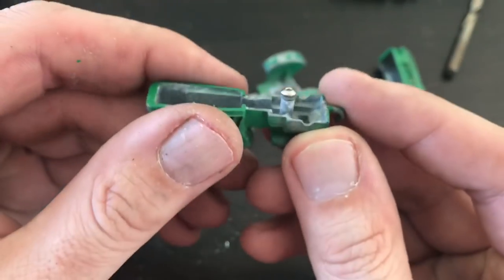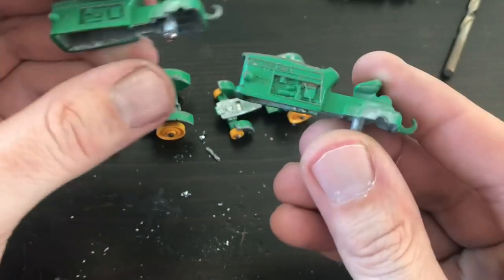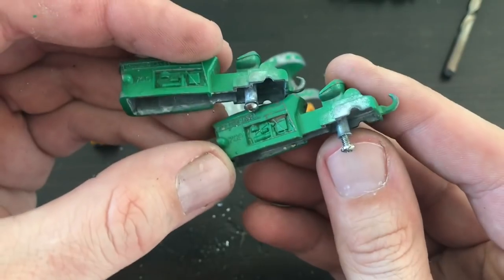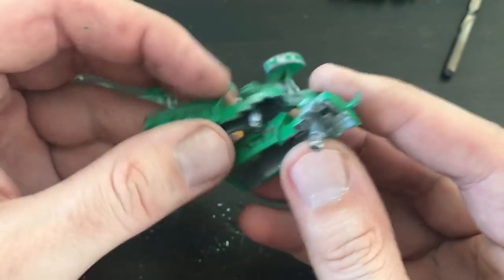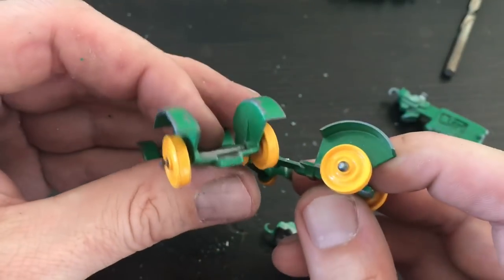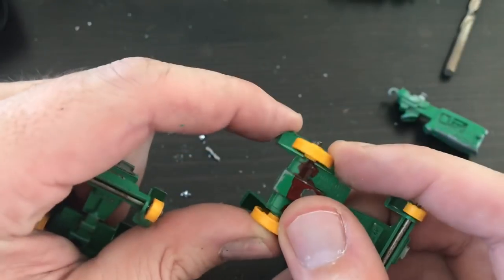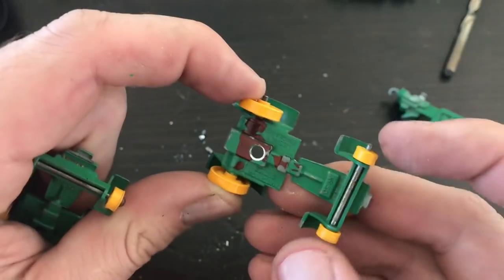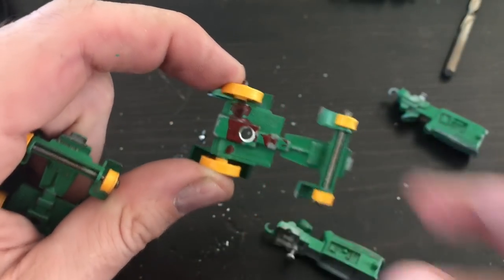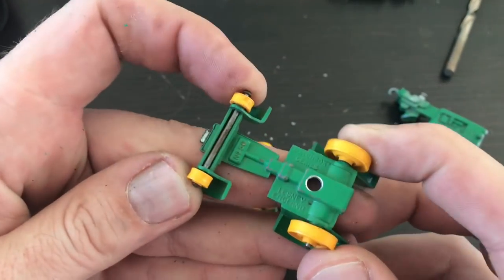With the castings apart, I've gone ahead and threaded our original inner hole, which sets it up so that I can use these button head screws for when we get ready to put these castings back together. The next step will be to remove the wheels and strip off all the remaining original paint to get these ready for a respray.